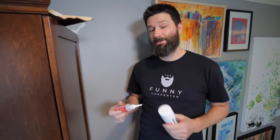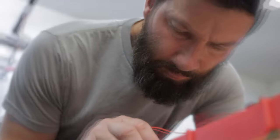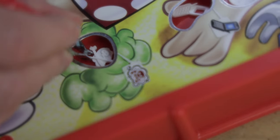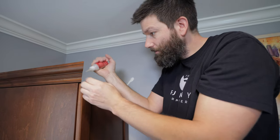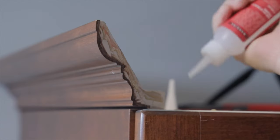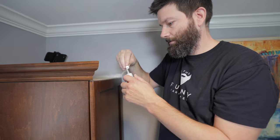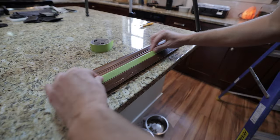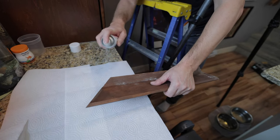This is something I've learned over eight years of using this instant set glue: once you start getting it on and spraying things, your heart's going to start pounding and you're going to get nervous. What I like to do is just breathe slow, take a deep breath, keep calm, keep your fingers still. You've practiced the fit and it's just a matter of executing. Get the glue on here, just going to keep it towards the back of the miter. Apply a healthy amount along the cabinet here just because sometimes these cabinets end up sagging down. I'm going to put a little piece of painter's tape so the spray doesn't get on the bottom. Now we're going to get the activator on here — healthy amount.